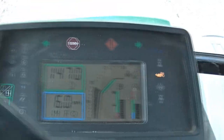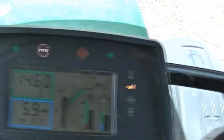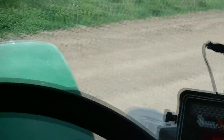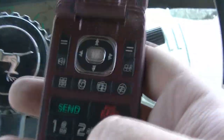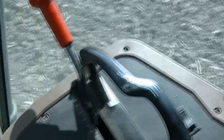Now I turned on the 4-wheel drive, and the GPS is saying 5.7, 5.8, and the tractor is saying 5.9 — which is good because that means we're getting more traction. Going downhill it's reading 5.8 and 6.1, so we type in 5.8 divided by 6 and we get 96%. So we gain another 3% traction just by turning on the 4-wheel drive, which is nice.